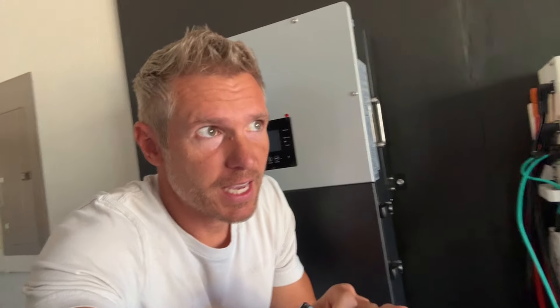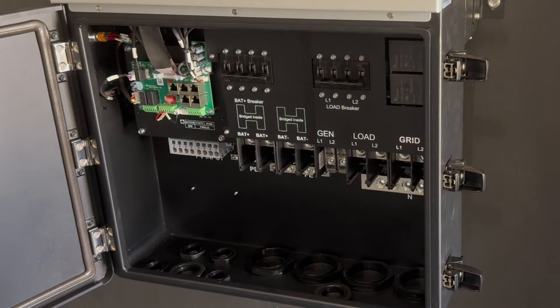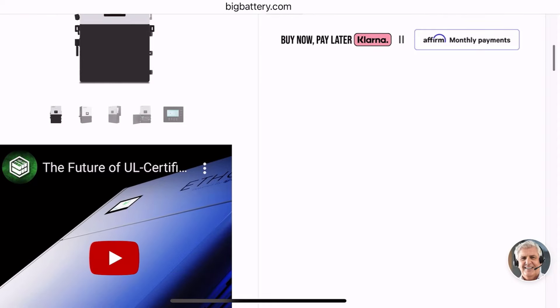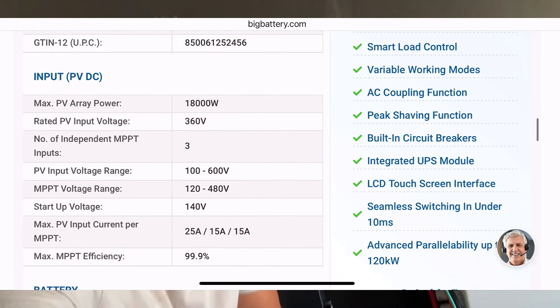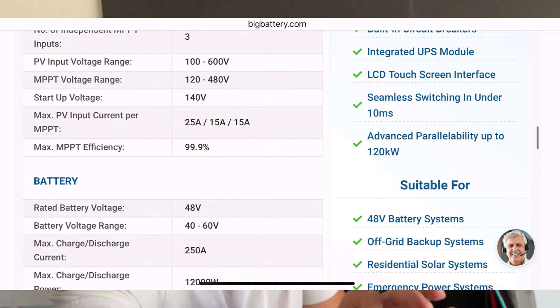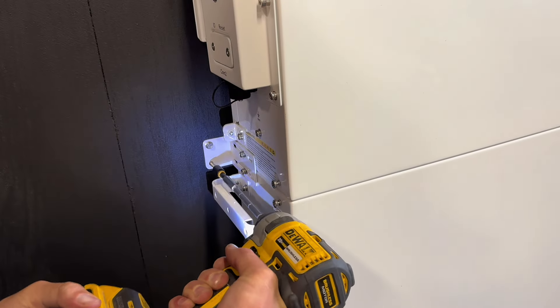With that battery, you need an inverter — that's the brains of the system. It takes the DC power from the battery and converts it into AC power. You don't want to skimp on the inverter. With this system, I went with the hybrid inverter, the Lux Power inverter, which is programmed to work seamlessly with easy setup with the Ethos battery system, and it's just about as plug and play as you're going to find. If you're slightly capable and you like to do DIY projects, you can do this without hiring an electrician. However, if you want an electrician to come in and do the final connections and check the system, that might be a really good idea. This process saves thousands of dollars, and I'm a DIY guy, so this was a huge selling point to me.